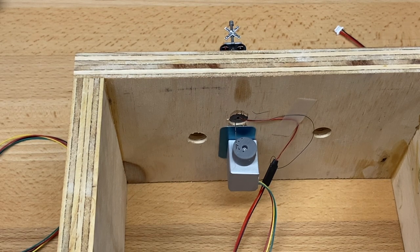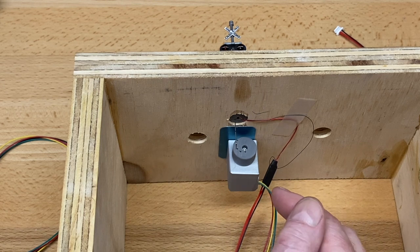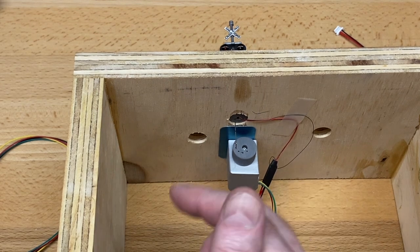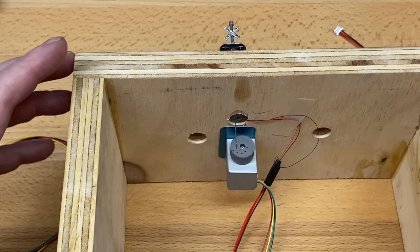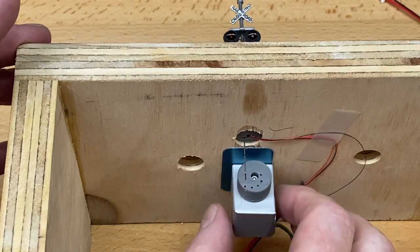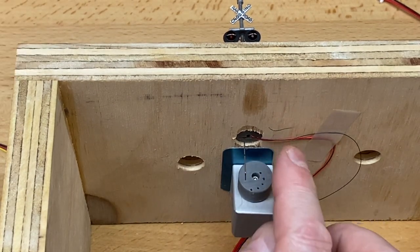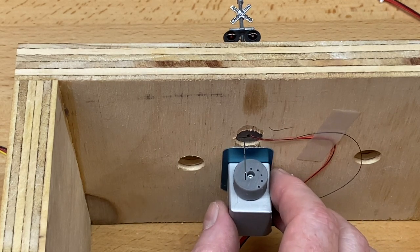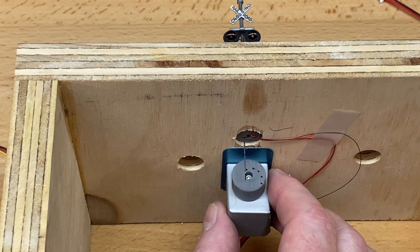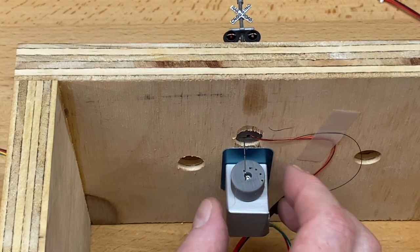So what we're going to do is use the top alignment mode, which is 3 push buttons. So 1, 2, 3. And always that mode, top alignment, as shown in the chart, is going to go counterclockwise. You can see the top dot now is coming into play at the very top of this, sort of up is that way. And what I'm going to do is stop it when the second dot gets to be about top dead center, because that's the standard HO hole location.